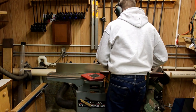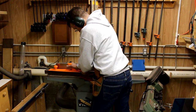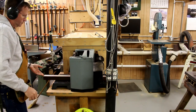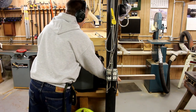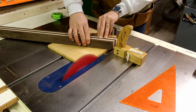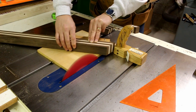Now we're back to our five-layer lamination. After gluing it up, I run it across the jointer to get one smooth flat face. Next it's off to the planer where we put it through to make both faces parallel to each other. Once that's done, I take it to the table saw and start with a jig to cut it off at a 30-degree angle, using a magnetic handhold as a stop so that each piece is the same.